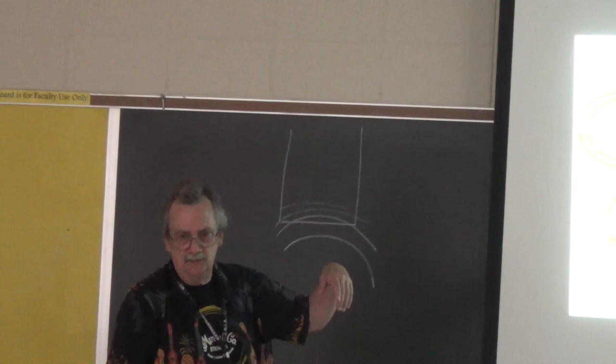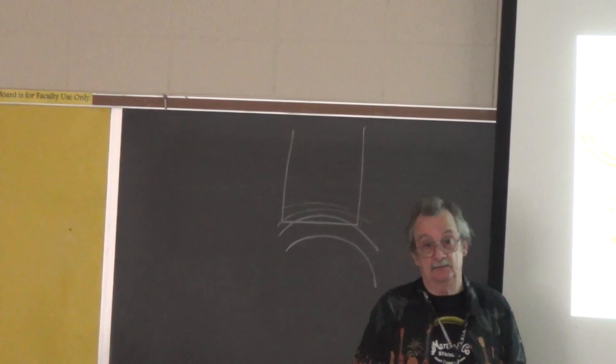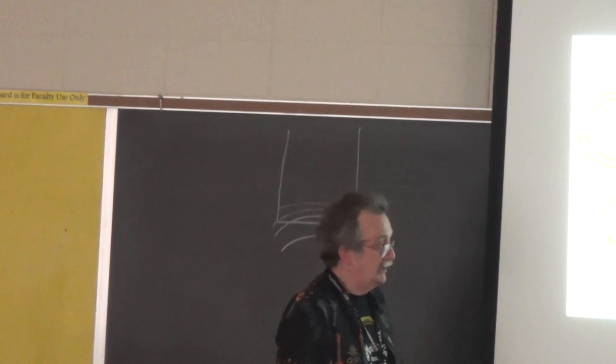On a headstock, especially on a slot head, you really want to get your headstock veneer on and trim and slots trim. Because if you don't, and you get your center line, because you want the center line to the slot itself, if the slots are off a little bit but you're on the center line, they're going to look off. So you always want to go to the center of the visible tail lip.